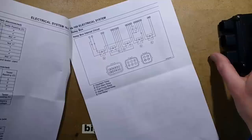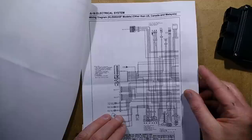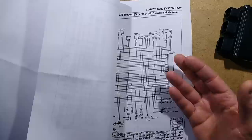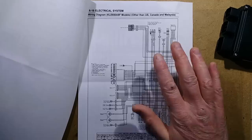And the schematic — when you see something and you're going to fix something and you see a schematic that looks just like a rat's nest of wires, don't panic. All you have to know is that you don't have to take it all in at once. If you've got a problem with one specific thing, all you have to do is trace those wires back for that individual thing. You can check them for shorts, check them for voltages and continuity. You don't have to worry about the whole drawing — just concentrate on the wires that are of interest.